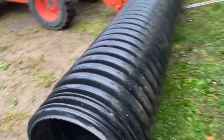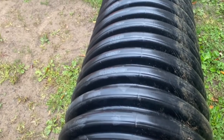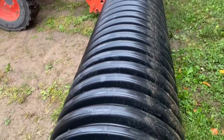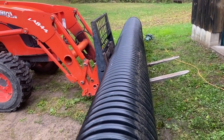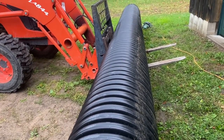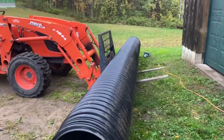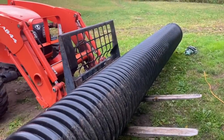I'm going to use these — there's a mold line in the culvert pipes where they seam them together and I'm going to cut it right there. That'll make two 20-footers, and then I'm going to take one 20-footer and cut it into a 12 and an 8. So I'll have a 20, a 12, and an 8-foot long shoot for concrete, because we've got to shoot one of the jobs we're doing. I can't get a pump so I'm going to shoot it through this pipe.